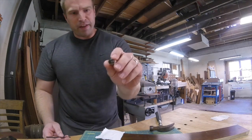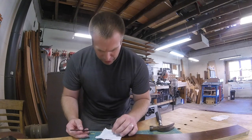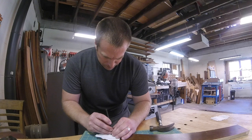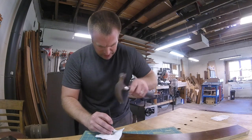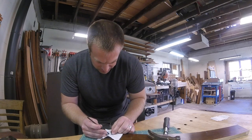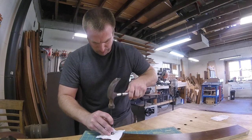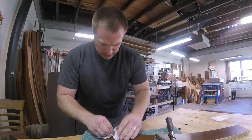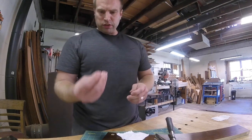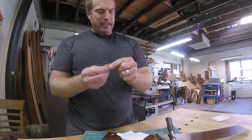Inside of the cap there's a little divot where the insert comes through, and you'll just want to get that with the punch. So I set it in the hole that I drilled out, put the punch there, and give it a tap. Sometimes they come out easily, sometimes not so much. And there we go — the little insert piece is out and we'll be getting rid of that.